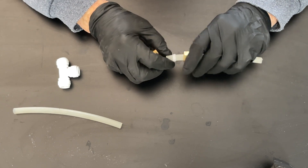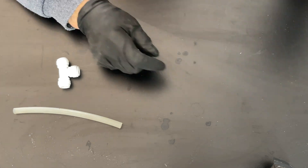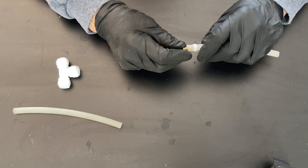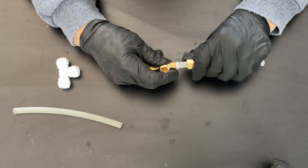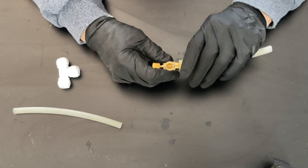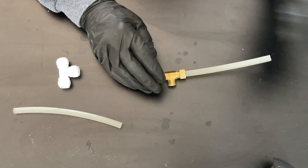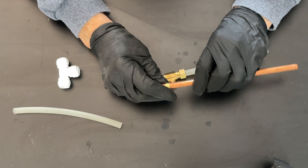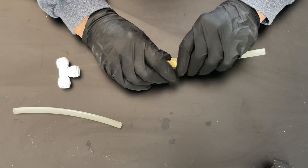If you're going to use brass fittings with plastic tubing, I like to use Delrin plastic compression sleeves, usually with an insert. These fittings are always designed according to the OD of the tubing — the inside diameter will vary depending on wall thickness. I put an insert in, use these Delrin compression sleeves, and just tighten that down. The nice thing is, if you change your mind, it's not that hard to get it apart, get the sleeve off, and start over. Unlike brass barrel-type inserts that get locked in once you swage them down with a nut, these plastic sleeves won't do that — you can get them back off.